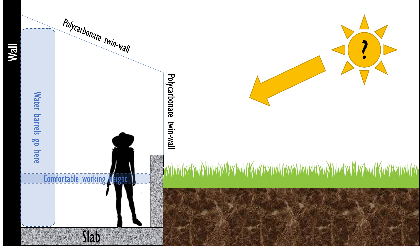That just leaves me with solar angles and designing my shading to maximize solar gain when I want it and minimize it when I don't. Most tutorials tell you to look at the angle of the sun at noon on the shortest day of the year. I prefer a slightly different approach: not to maximize daylight on the shortest day, but to maximize solar gain on the coldest time of year when you really need the heat.